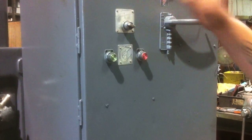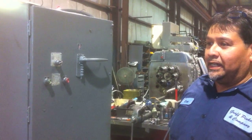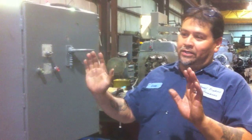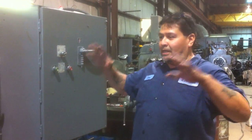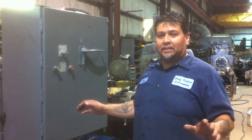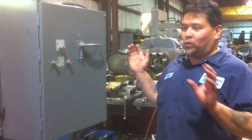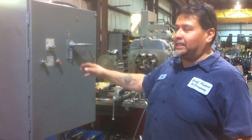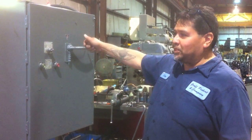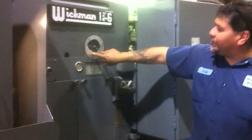What happens is you go ahead and turn your machine on, put it in gear, flip your switch over. Then it's going to go in and do your part — all your slides, your end two slides are going to come back and stop with everything back out of the way. So that's just like a one cycle. If you want to just do one part, let it all come back and stop on its own automatically, you just flip the switch over. It'll go to the end of cycle and stop right in this position.